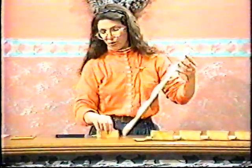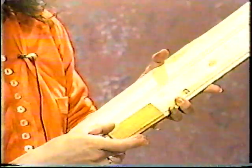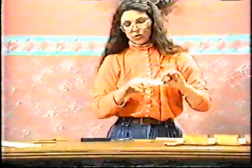And for the little shelves that I have here, what I did was I took the piece of scrap that I had, and I cut right along this bead, and I'm using this as the front. So I cut right along this bead here, the second bead, so that I'd have a little notch for the front of the shelf, and then I just rounded it off. And on the back, because I've got one finished here, here's what it looks like when you get it all cut out. You got this little notch, and on the back of this, this is tongue and groove.